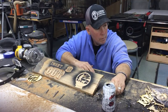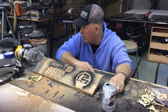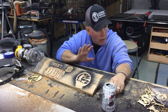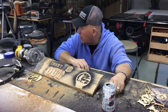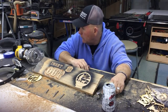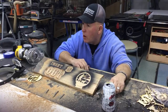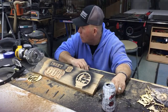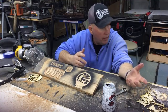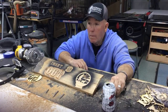Are those diamond wheels any different than the grinder over there that's got 8-inch wheels? Is it the same material? Oh, I'm sure it's different material, because this is diamond impregnated on the actual wheel itself. What are your grinding wheels? Do you have a diamond wheel there? Is that CBN or Carborundum? No, the one on the Delta, right in front of you. Is that diamond? Yes, that's diamond. Oh, well then, you've got it. If that's a diamond wheel, then it'll sharpen carbide. Can you do carbide on CBN?